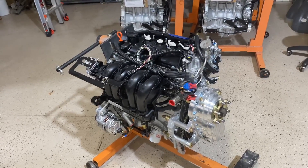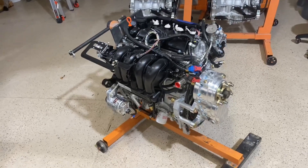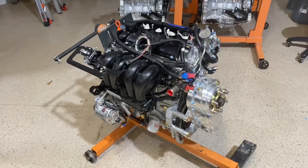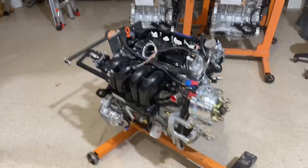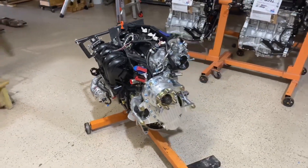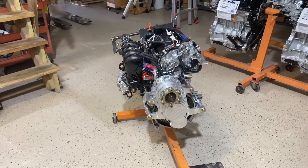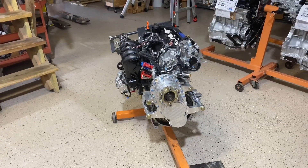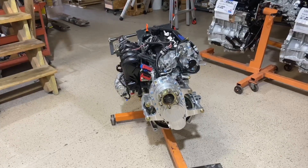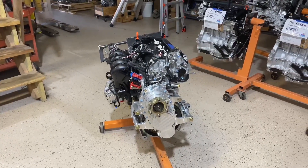Pay attention to the newer Viking Views — they do have two different lengths of cables supplied for the pressure transducers. Use the long one to go in the back of the airplane and the short one for the front. Excess cabling should not be shortened; just coil it up. You can coil it and tie it underneath your tray between the instrument panel and the firewall, so you don't have as much cable on top where you want it to look nice and organized.